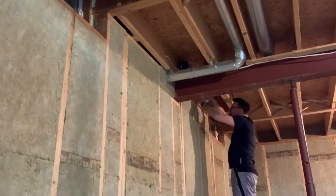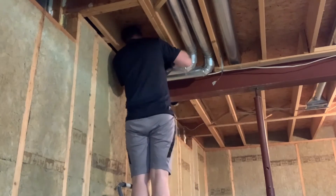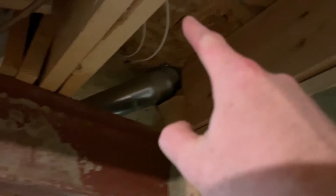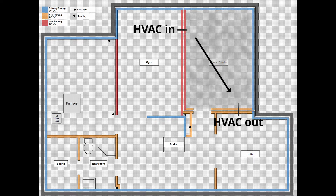When I started building the music studio I had an unfinished basement to work in. For the HVAC, that meant that ducts were running wherever they needed to in order to get fresh air to the rest of the house, so some of these needed to move to make space for the studio. Here's one of the ducts that ran straight through the front of the room — I tucked that one into the floor joist area and ran it around the other side of the I-beam. At the back of the room I rerouted all the ducts tight against each side. The furnace is on the opposite end of the basement from the studio and the largest duct that could travel all the way from the furnace to the studio was six inches in diameter. I was determined to have both the supply and return in the studio because the room will be completely sealed, and it's best practice to put the supply and return vents on opposite ends of the room to create the most uniform distribution of air.